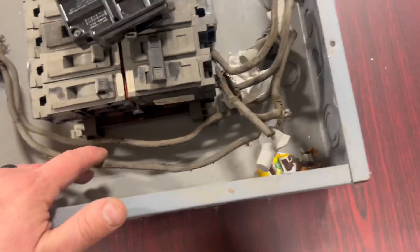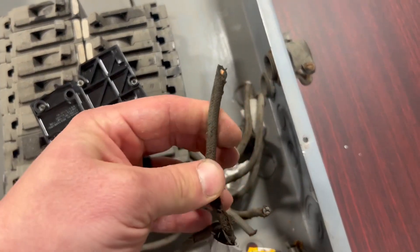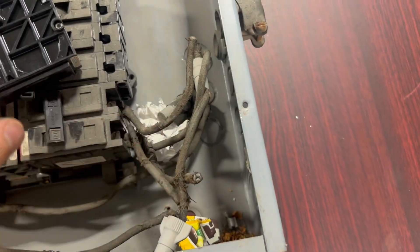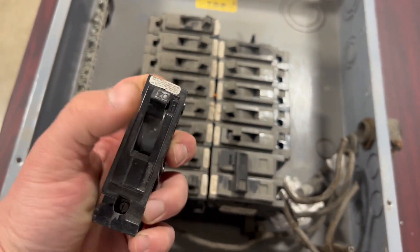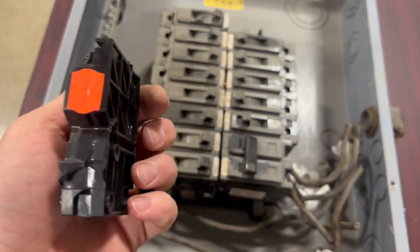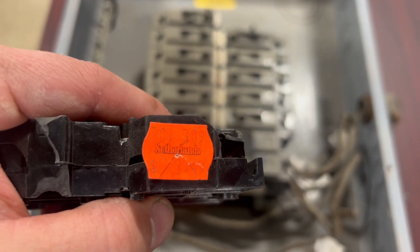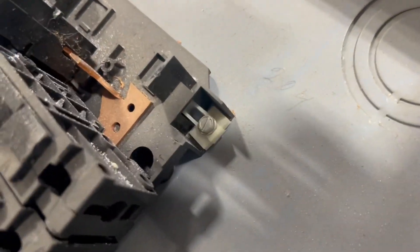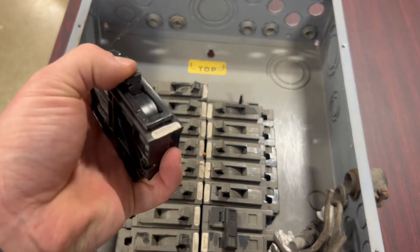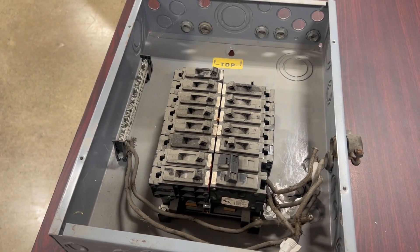You can tell this one's really old because it's got old knob-and-tube style wiring inside it, so it had been around for a while. The breakers are kind of interesting — they've got a real satisfying snap action, but they're very lightweight, not much to them. This one is from a bygone era when breakers cost three dollars and forty-two cents. It's got copper bus bars — that's a nice feature. 20 amps. General Switch — I don't know anything about them, but there's one without the cover. Thanks for watching; we'll see you in the next one.